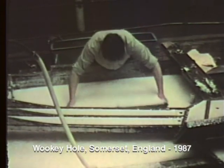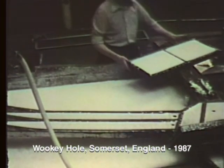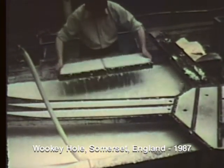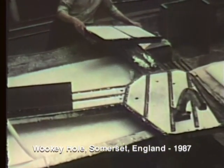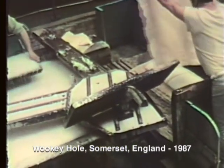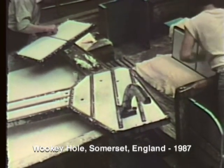To form the sheet, the papermaker makes one dip into the vat toward him and disperses the pulp over the screen from side to side, or front to back, or both, throwing off the excess at the back. In a large sheet, this looks like a wave. Two people work together, a vat man and a coucher, and a separating felt is used between the sheets. The fiber used here is cotton with no formation aid, and that's typical of European papermaking methods.